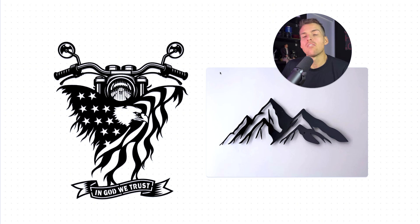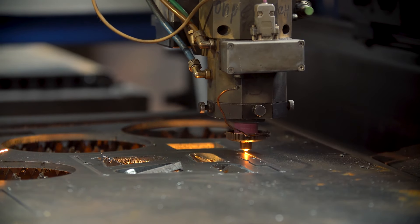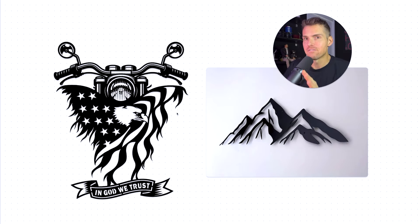Something else to be mindful of when creating your designs is that you're not creating weapons. These pieces can be super dangerous because they're cut by a laser cutter and can be very sharp. This design on the left — and the one on the right — are good examples of how not to create your designs. Each of those sharp points has the potential to injure your customer. You want happy five-star reviews, not lawsuits because they've stabbed themselves with one of your designs. Always round out those ends — it still looks really good, it just removes that potential injury risk.